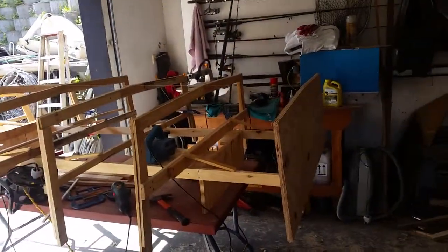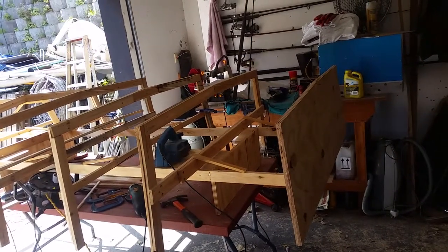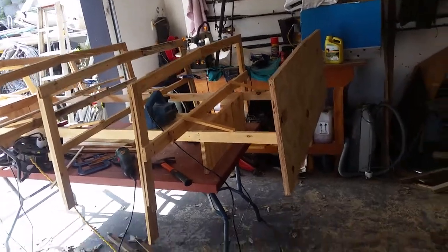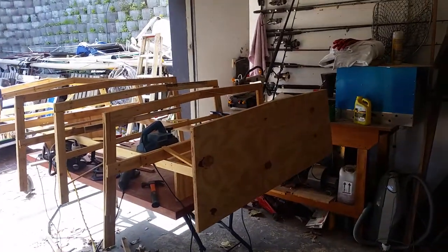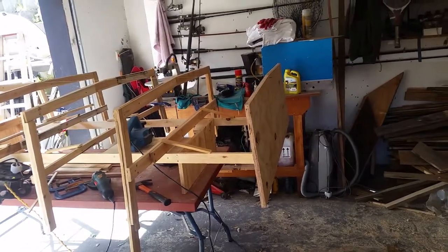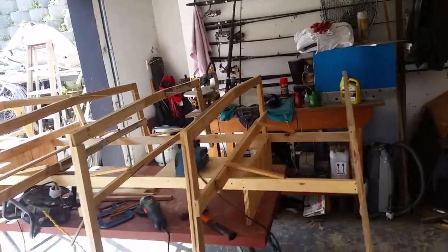So, 3.2 meters — that's roughly three feet in a meter, so call it 10 to 12 feet somewhere in that region. You can see all this wood lined here — that's going to become the stringers. They'll line the boat, and on top of that we'll put four millimeter plyboard, sealed with wood sealer and a normal yacht spar varnish.